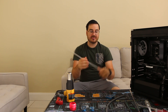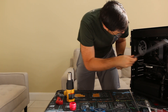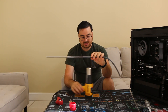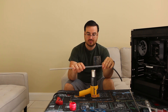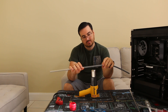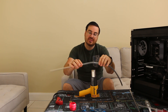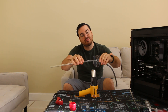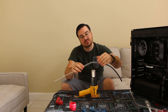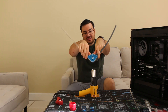All right, now let's start with the bending of the PETG. With this one it should start bending at a lower temperature. So I'm going to use this tube and bend it around here. You see how fast that starts to bend? With this one you're going to have to take it away — it can't be as hot. So bring it further up with the PETG compared to the acrylic. This is bending very quickly. You can use the angle guide if you want — just bend it around. And that was much easier.